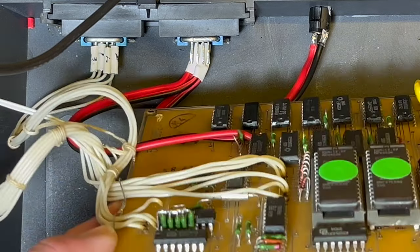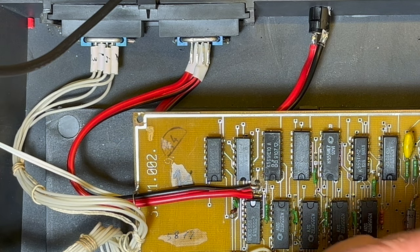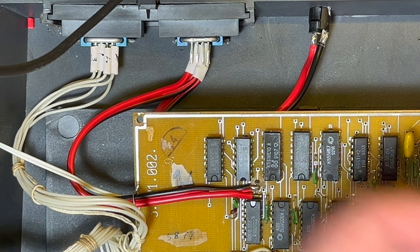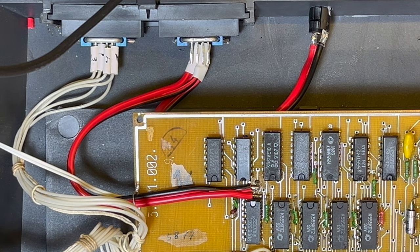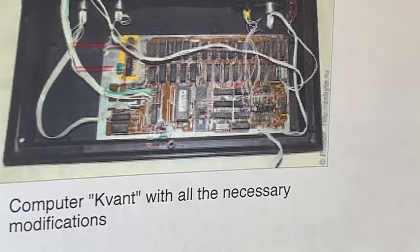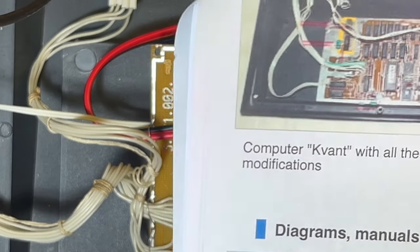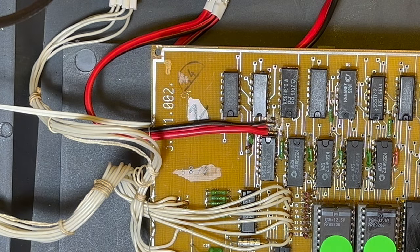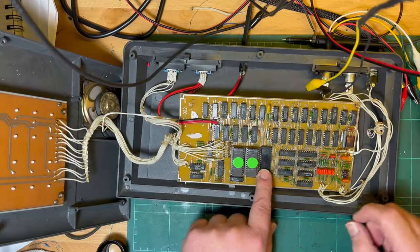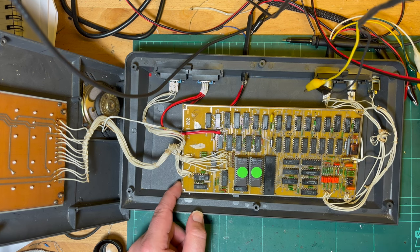On the Z80 I'm just trying to think of the best way. I'll look at some pictures - there's quite a nice ground plane visible if you click on the links on the website. You can see quite a thick grounding strip and up here a big grounding section, very different to ours. So the CPU is there, the data bus is on this side here. Let me power this off - it's been running long enough.